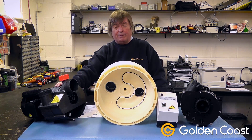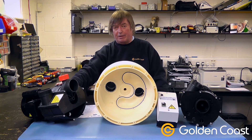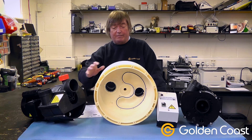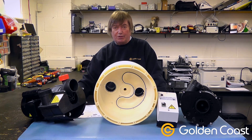This is a pump that's made for mounting remotely — as you can see, the head is completely different. This is a self-priming pump and it can be mounted in the plant room away from the niche. The most important thing to remember is that if you're mounting pumps further away from the niche, certainly a meter or two, you need to increase the pipe sizes dramatically, otherwise you won't get the flow.